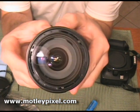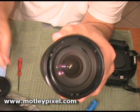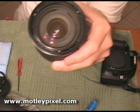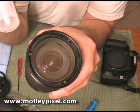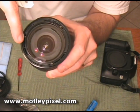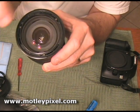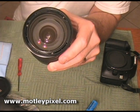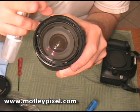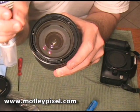The lens is now immaculate — I really can't see any dust in there now, so I'm pretty pleased with that. Next step, I'm going to put this cover back over the screws. To help mitigate future dust coming in, I'm using silicone — put just a light bead over the slot on all three places, then lay the cover ring over it and gently press it into place. That should be plenty to hold it, and it will be serviceable in the future since you can get in there with tweezers and peel the silicone right out.